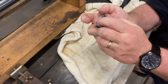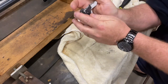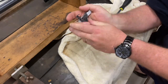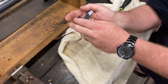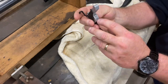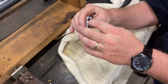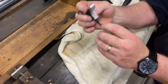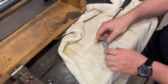And the way you tell that she's a two-stage trigger is the safety. You've got the HOWA three-stage safety. Stage one, right at the back, everything will be locked up. Stage two, in the middle, you can still action the bolt, etc., but can't crack the trigger, and stage three, she's at full fire. That's how you tell them. Also they've got the little screw at the front and nothing at the back. The single stage triggers have a big bolty looking thing at the back. And what we're doing now will only work for these two stage triggers, because they're two springs, obviously.